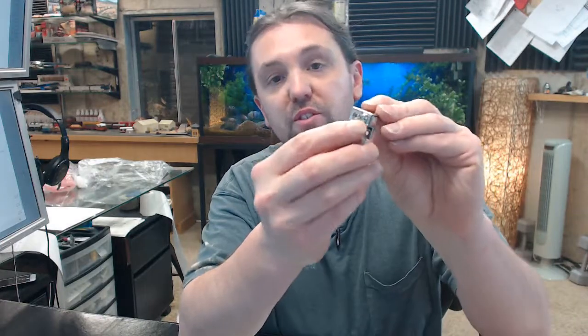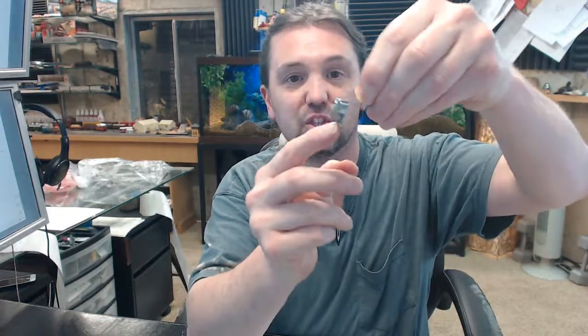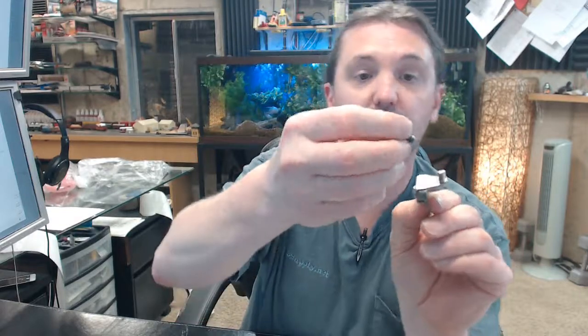You will have a door that is inset flush to the face of the frame. This is a concealed set of pivots. You remove this screw here and then this backer plate will come off — screws are not included by the way — and you will attach this backer plate to the inside face of the door. Then you will drill a hole, which they spec as 23-64ths, for the nylon bushing that goes into the header of the cabinet. There is a link below this video to a cut sheet with dimensional drawings showing how this item is installed.